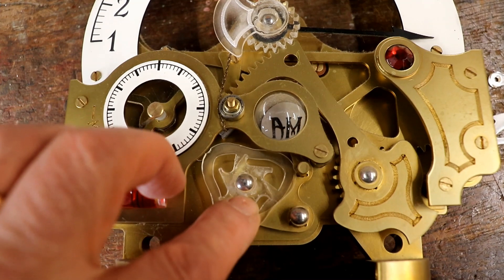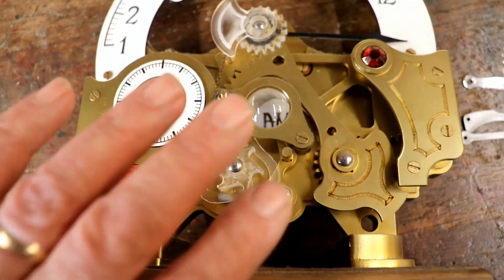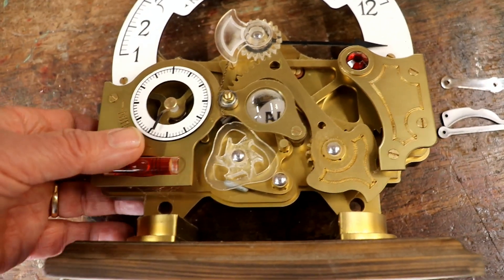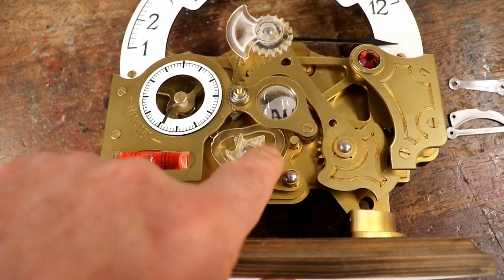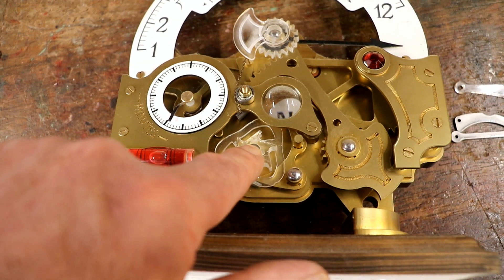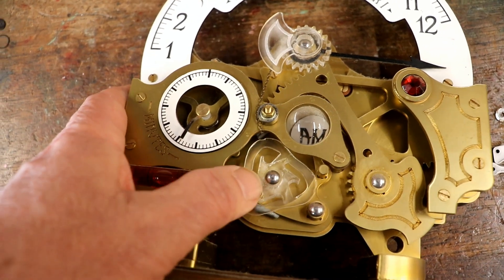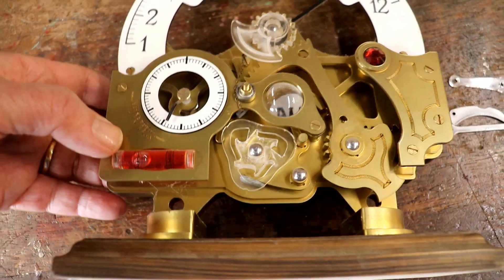Because of the momentum with all that falling down, it spins this too far. I've tried all sorts of things - little dimples here, you name it, I've tried it. This is what's held the project up for five years, would you Adam and Eve it. And then I realised I could add a little bit of felt, a felt disc in the back of here, and replace the axle with an adjustment screw, which worked really well. It meant you could fiddle around until this was stiff enough not to run past, but not stiff enough to stop this from falling down. Get my drift?